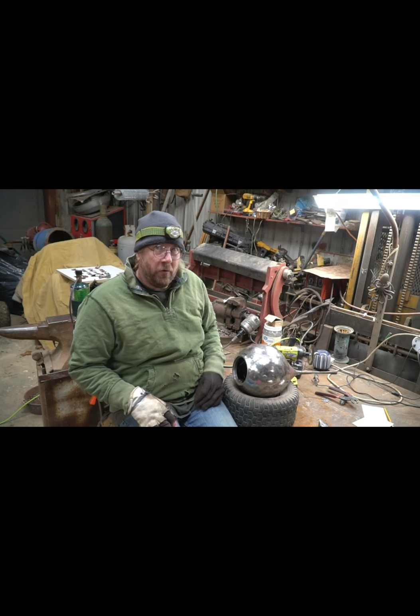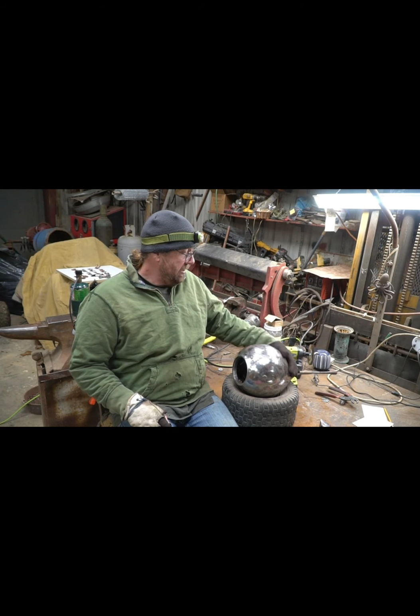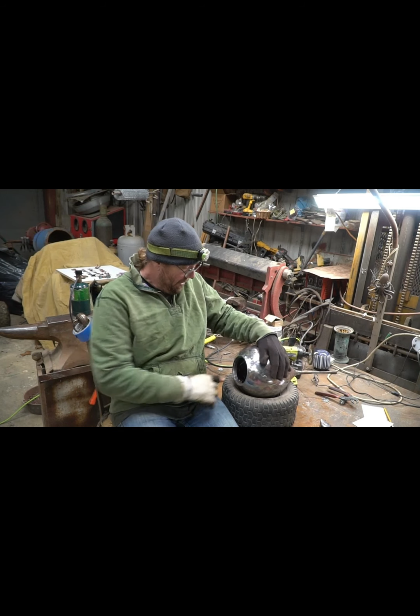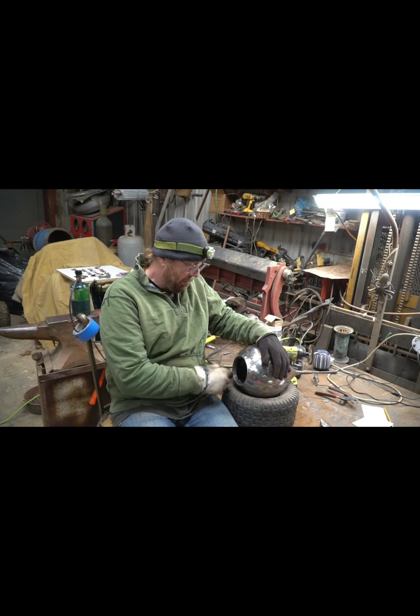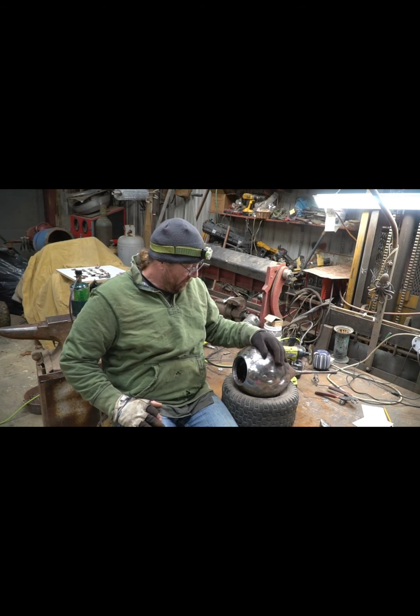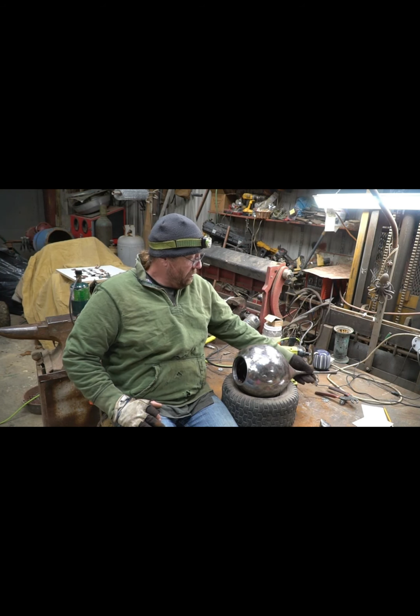All right, finally moving on to the final phase. Gonna have to cut the final dimensions. I've got to stay less than 4 foot. Got to clean up some threads where I left a plug in it while I was welding and it arced off to it, so the threads are a little boogered. I'm going to start out with Dremel tools, try to clean up with Dremel tools, and then do my final shape,